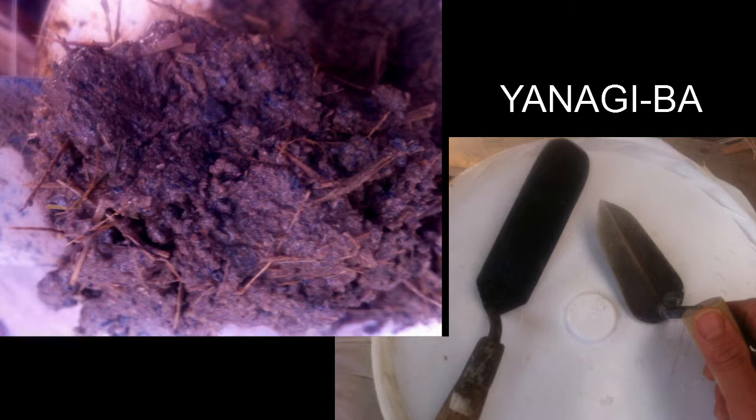Start with a 2-to-1 mix, 2 parts shape coat mix, 1 part sand. If it is too crumbly or stiff to manipulate and stick to itself or the wall, add more shape coat mix. If it could use more sand, add more sand. It should make a pretty loud grating sound while you're mixing it.